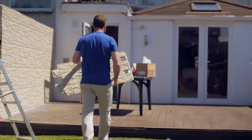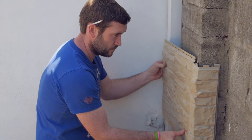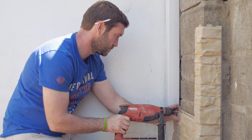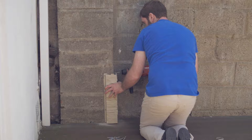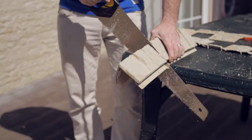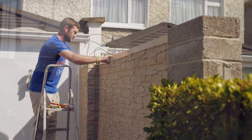On the second wall in this decking area we have fixed the cladding directly to the wall itself. In this case, use the drill, insert a raw plug and screw the panel directly in. If there is a corner in the area, as there is here, always start there, mounting the vertical corner sections first, starting from the bottom as before. Cut your edges and the top to fit and once it's all nice and even, cut some trim to finish it off.